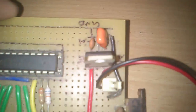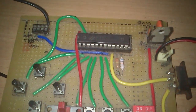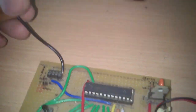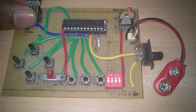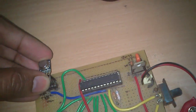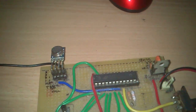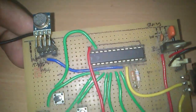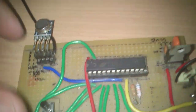I have two filter capacitors just to filter out any unwanted signal — I'm using it with a DC battery source. Even without the capacitors the circuit will do just fine. The single standard wire you see here is my antenna for the transmitter. The missing part in the circuit is the RF transmitter, which is a 434 MHz transmitter — it's basically a 4-pin module where one pin goes to ground, one to supply, one to data, and the fourth is the antenna pin. The transmitter has a decent range even without the antenna, but connecting a single standard wire extends the range.